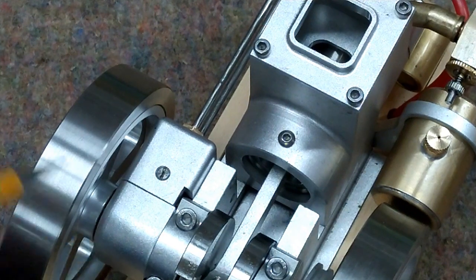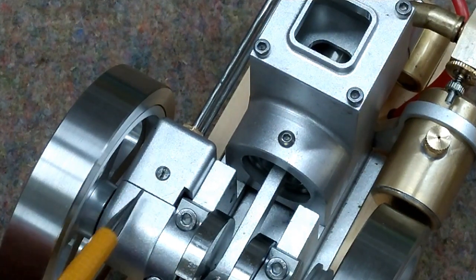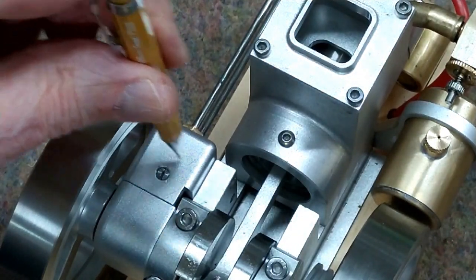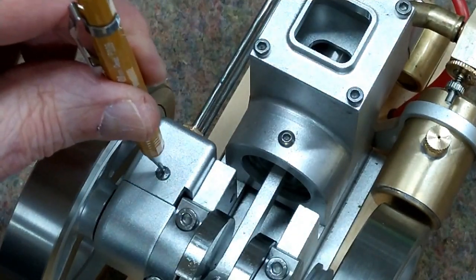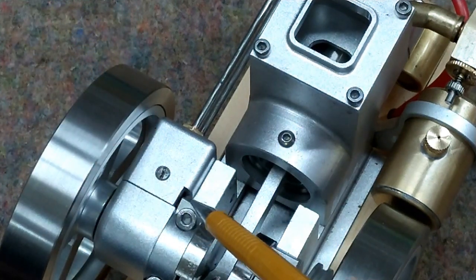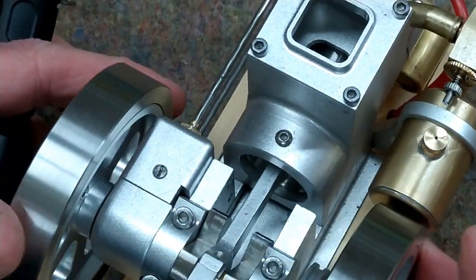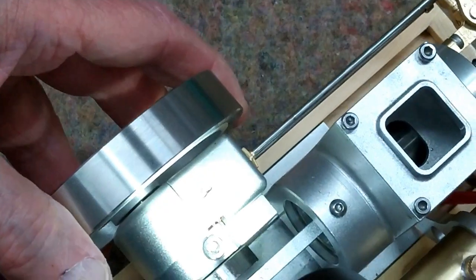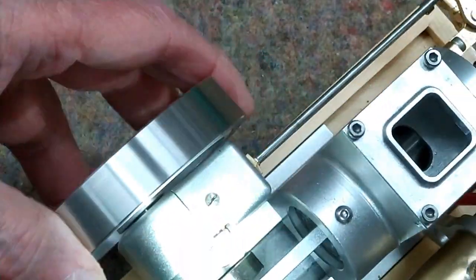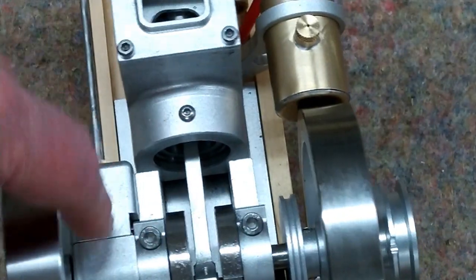I have found one way to get oil in here to where the cams are. This is a set of helical gears. You don't want to take this screw out because there's a gear that runs on that — this is actually an axle. Right in here you can dribble a little oil in, then turn this as you're doing that. You can see that gear turning back and forth in there. That's the only way I've found to get oil in here.